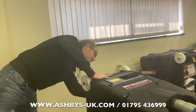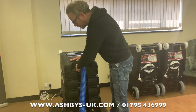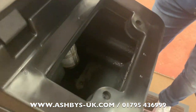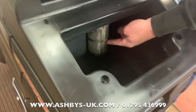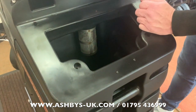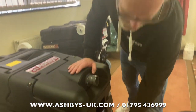To switch off: switch off the water pump, then vacuum motor number one, then vacuum motor number two. Inside the recovery tank, there's a high-level safety shutoff with a float ball. As the water level rises, the float ball rises, air pressure sucks it up, and it mechanically blocks your vacuums — the motors will sound high-pitched with no vacuum. At that point, switch off vacuum motor number one then number two and empty into your designated dirty-water bucket.